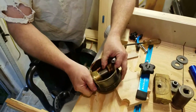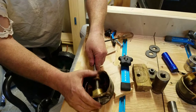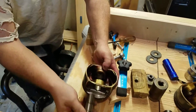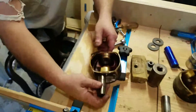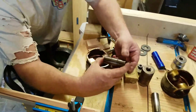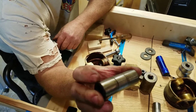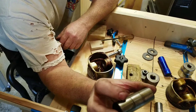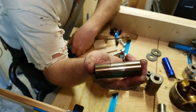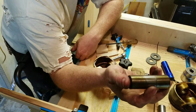On the new pins and pistons, the pins spin freely because they're supposed to lock on the rod, not the piston. If you look at the coloration on an old pin, the center is nice and shiny while the outsides are bronzed out — that's oil buildup from between the pin and piston boss. The center has no oil buildup because it's a tight press fit there, so it doesn't turn brown from heat. That tells you exactly where the pin was locked in.